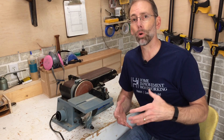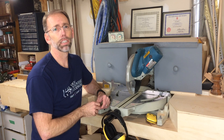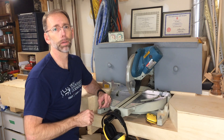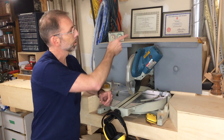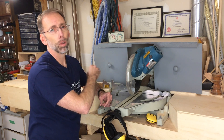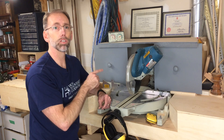But what do you do with the larger tools? For larger tools, you need more airflow, and to get more airflow you need a larger vacuum — and that's what a dust collector's for. Miter saws are notoriously dusty tools. That's why about 15 years ago I built this dust collection hood to help manage the dust in my workshop. This is based on airflow principles — air moves where there's the least amount of resistance. The air gets pulled out from the dust collector and is managed through this opening. The smaller I make this opening, the more suction I have. I've got a separate video on this, but I'll give you an example of how well this works.